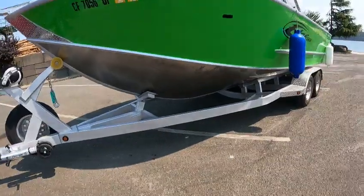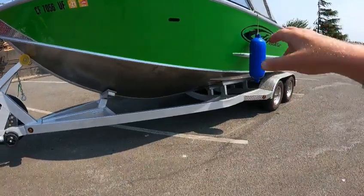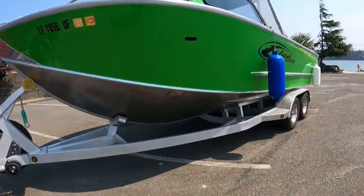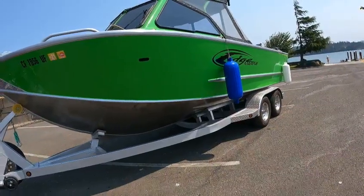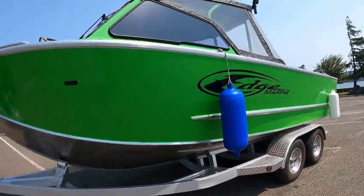So this virtually, unless you submerge the trailer, with that V block and those double bunks with the decking on them, and we flip them upside down so the groove gets the water up on there, it acts as an air hockey. So it just slides right on off, and you got big strakes, lifting strakes, which actually helps lift. Plus it helps keep this boat in a straight line at low speeds and high winds.